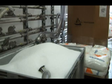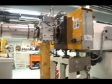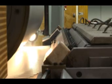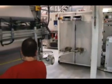If you wanted to make 75% recycled material, then you'd mix 25% of new polypropylene pellets with 75% recycled granules and so on. The molten polypropylene is then fed through a series of rollers to be squeezed and shaped into a long sheet of material. One of the rollers — the embossing roller — creates the frosty surface texture on the material as it cools. The polypropylene is then trimmed to the required width and the waste is fed directly back into a granulator to be extruded again.